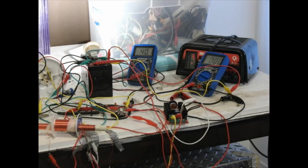only time will tell. The light is 100% lit regardless of if the PWM is on or off, because it is drawing directly from the battery. So at the very least, that voltage should be dropping significantly faster with a full load on it. It's a 6-watt LED, and it's full brightness, and again, it's hooked directly up to the battery. So at the very least, the PWM consumes 2 milliamps on its own without doing anything, so that's not even showing on the meter at this time as an input or a load.